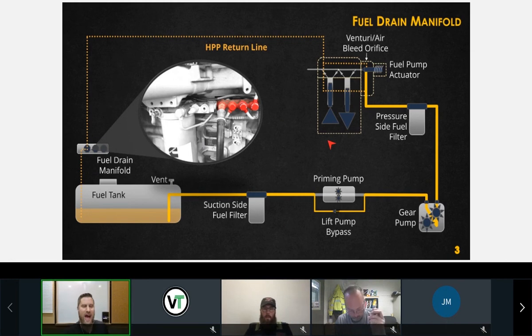All right, now the last component. So we got lots of questions: is the pump return fitting regulated? No, it's not. There's no regulation on the return lines. The only return that has regulation is the injector return, but it's not adjustable, and it's just incorporated into a banjo fitting on the back of the head. We'll talk about why later on when we talk about the high pressure side. There's no regulation on the return lines, so there's no regulator in here or anything like that.